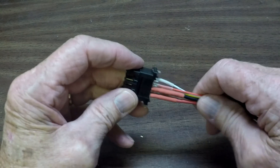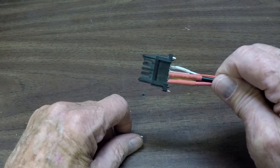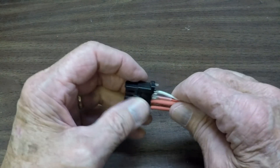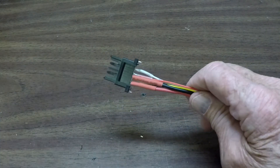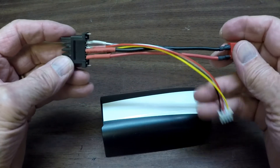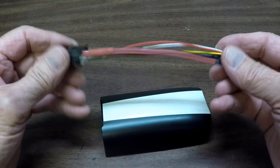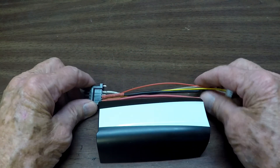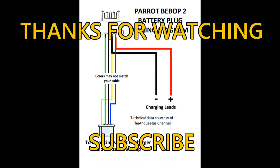You can get the wiring diagram, but be careful when you're soldering things together. Remember, do not have this plug stuck in the battery when you're soldering, because it looks like a good place to hold the plug, but if you touch two of those connectors together you'll get sparks. So there you go — got my balance charger, and don't have to mess around with paint sticks glued together or Play-Doh. I hope this is useful to you, and I want to thank you for watching.